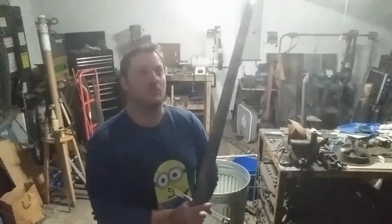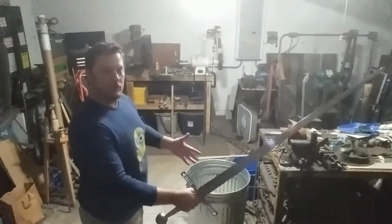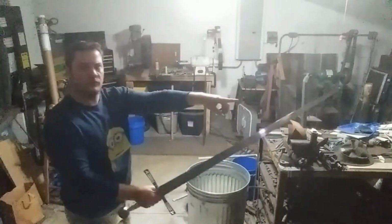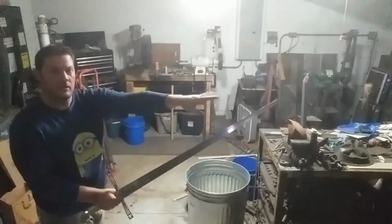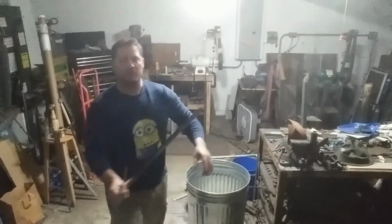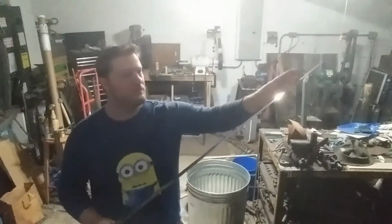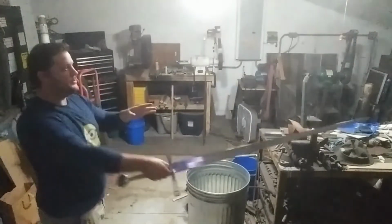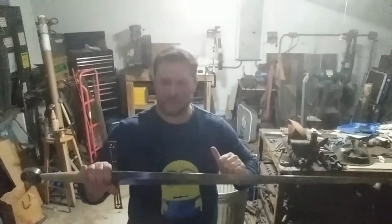The other thing we check is what we call the rotation of the blade. This is a little harder to check. But basically, for a longsword, when I'm rotating my blade, I want the tip to remain roughly the same. When I'm moving my hands, the blade tip stays roughly in the same place. It looks like I'm within 2 to 4 inches near the tip, which is good. The reason for that is for longswords, when you're going from your different positions, you're keeping your tip in the same spot. So it looks like we got that roughly right.